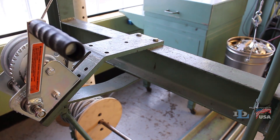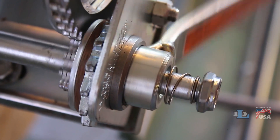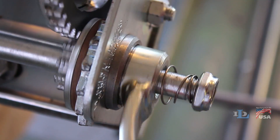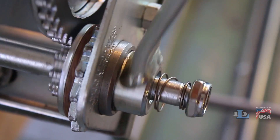When cranking stops, the load stops and stays secure without any action by the operator. When the winch is in operation, the amount that the handle hub moves on the drive shaft thread is imperceptible, but movement does in fact occur — just enough to keep the brake tight and secure.